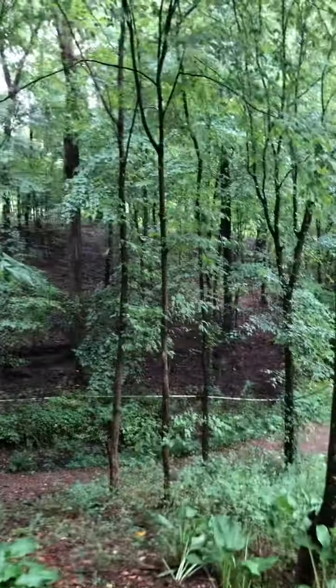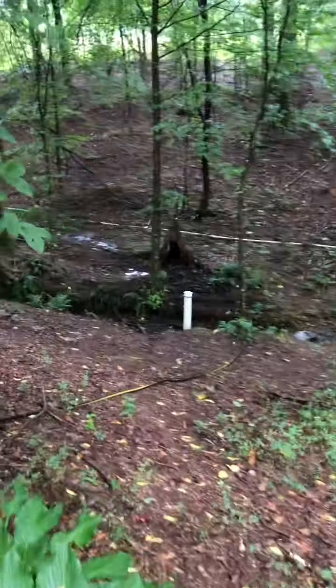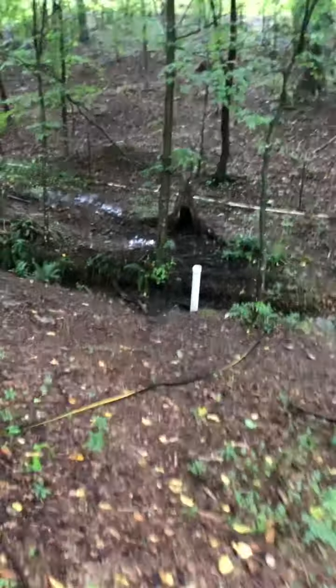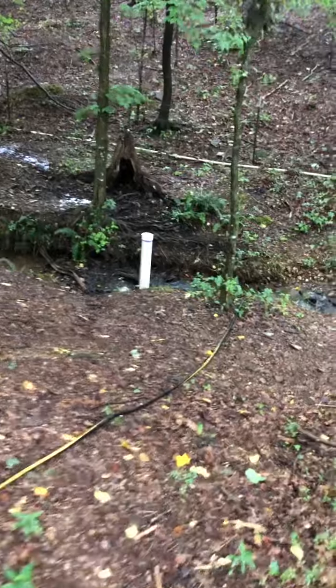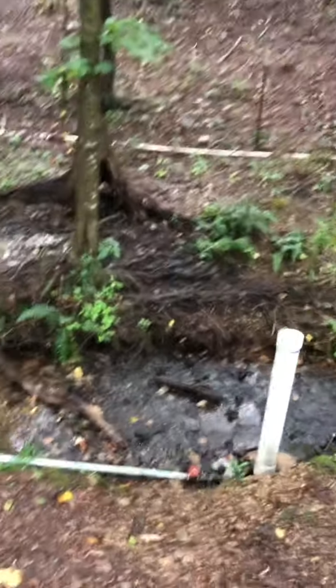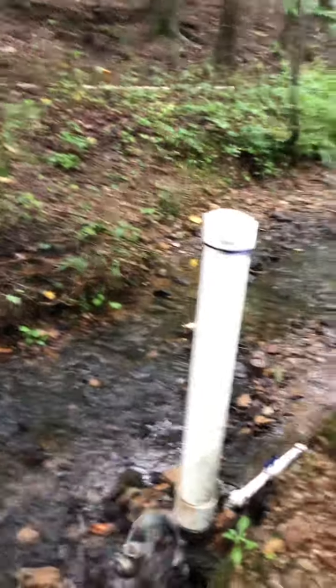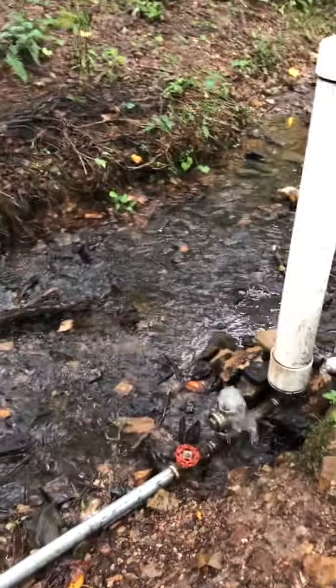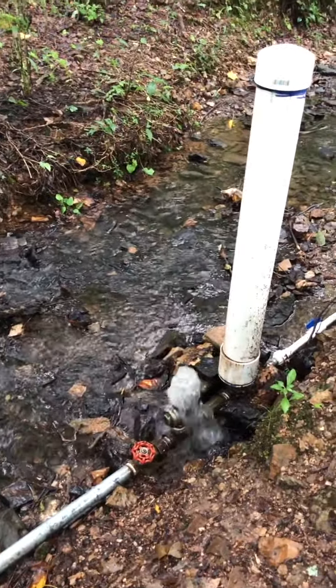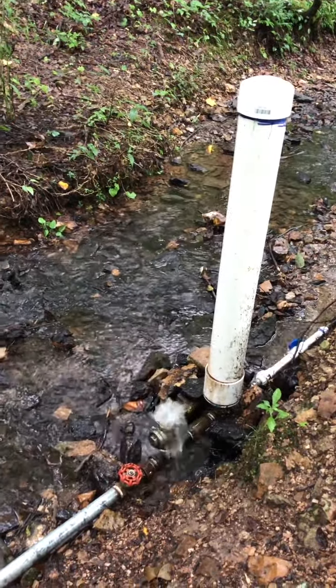Lessons learned. I built everything using brass parts in the beginning. Galvanized steel input pipes, valves were brass. The part that's sitting there doing the clacking, the waste valve, I wound up putting stainless steel on it, based on some other information that the brass would only last about 3 years, while stainless steel will go about 10.